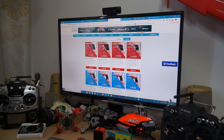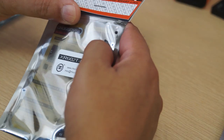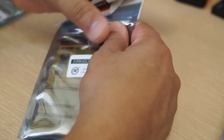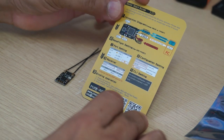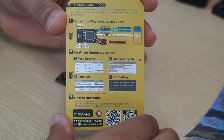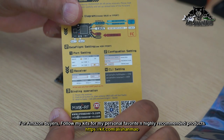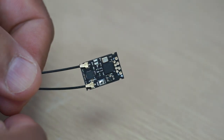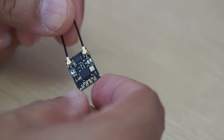So if you look at their website, I got the XR602TF2 for FrSky, and I got the XR602TS and XR601TS for Futaba SFHSS. They are packed very nicely. Inside the bag you have a user manual with instructions on the back side that are really brief and easy to understand to set up your receiver properly. It shows all the pins and where you have to solder. It also shows Betaflight setup, CLI settings, receiver settings, and binding procedure. The receiver is really nice and small — very easy to set up and install in your micro FPV quadcopters or FPV whoops.